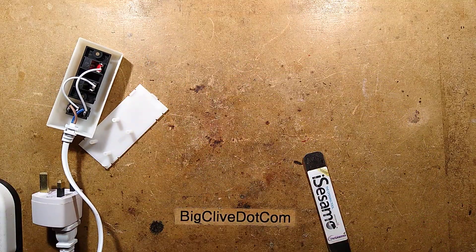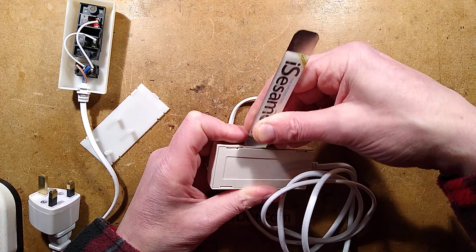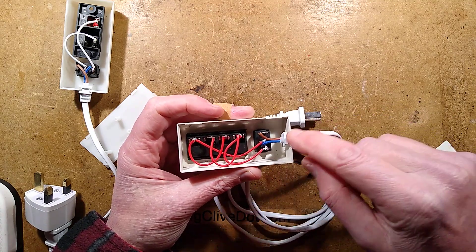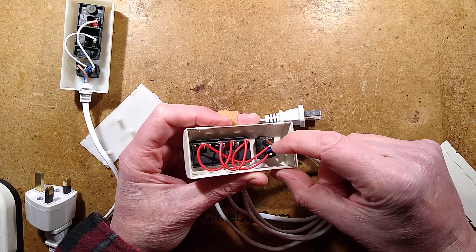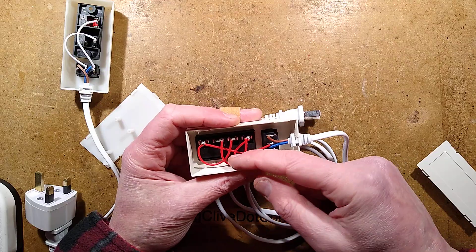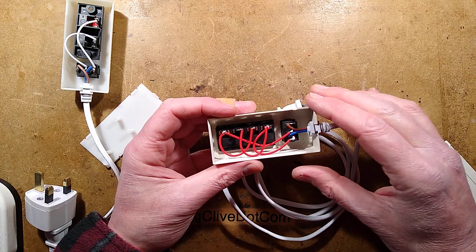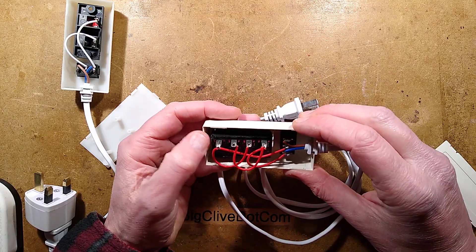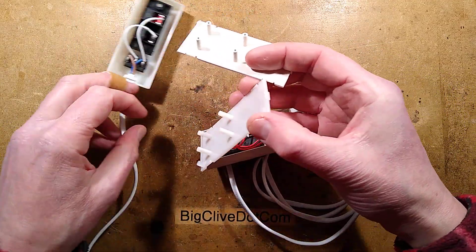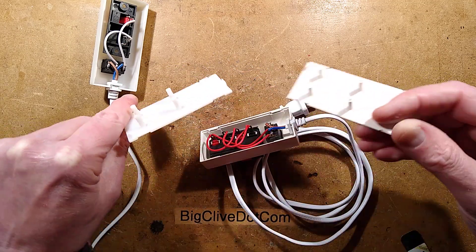The other version — let's pop this off. I was also hoping to find a three-phase version, the 380-volt version, but I did not find it. They have the neutral passing through on the neon connection and the live going on the switch connection, then the other connection coming out here — so that's reasonable enough. What connection do they have live going out to? They have live going to the red this time, so it's kind of random whether it's red or black. Are these pillars the same size — have they just optimized the base plate for the particular connector? They look pretty much the same size.